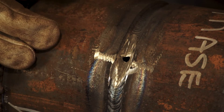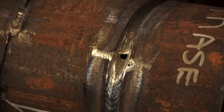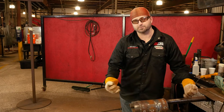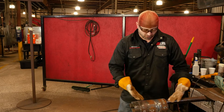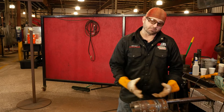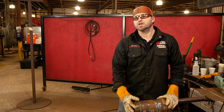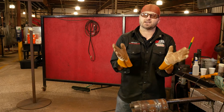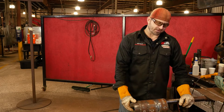It's thin right here. You are going to have to pay attention whenever you're putting your TIG root back in, because if not, it's going to want to rip open even bigger and make a mess. A lot of times the hole gets a little bit bigger and you're going to have to feed the wire in and keep the keyhole under control so it doesn't rip open and make a bigger hole. So take your time on the grinding, pay attention. Don't grind straight down — grind in, open it up, put it back to the bevels again so you can get a nice little root pass in there.